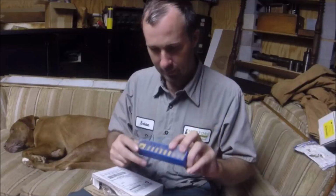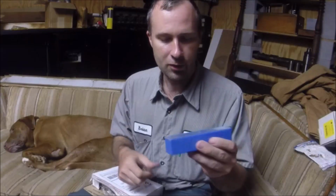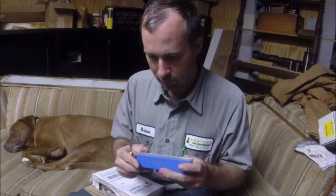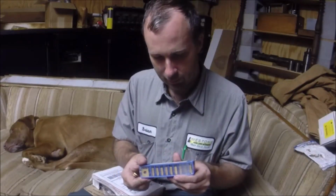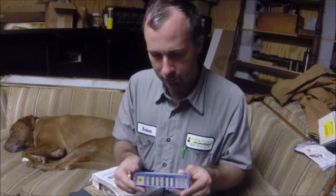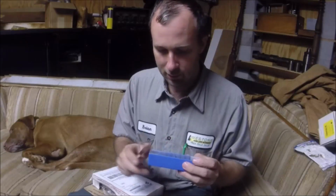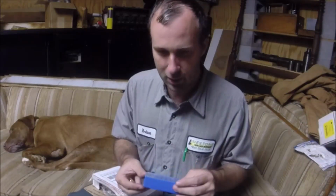So here's these SNMA 643s. Or, yeah, I guess that's what they are. It looks about right. They've got a pretty rounded edge. Not really marked for a grade, I don't think. So I don't know what they're supposed to be. They're probably a steel because they're gold. They're probably not cast iron. But I have to look through my cabinet and see if I've got a tool holder for these. I think I might. If not, we'll have to make something up.